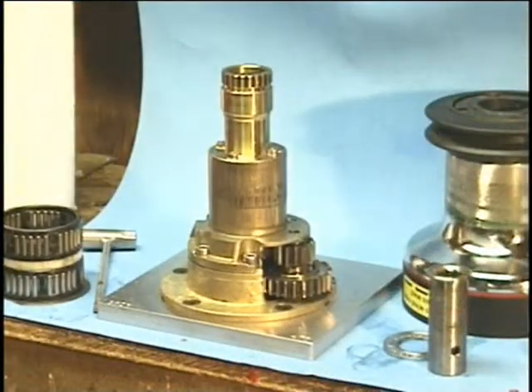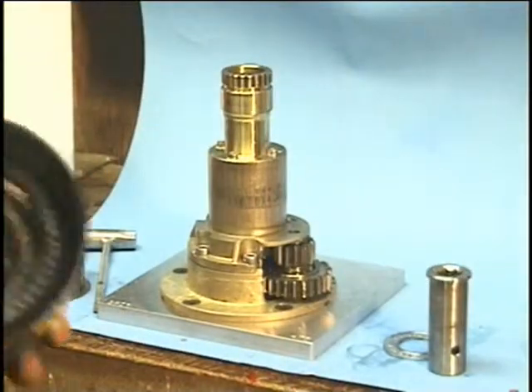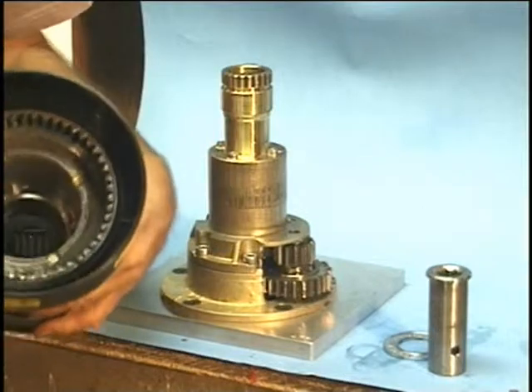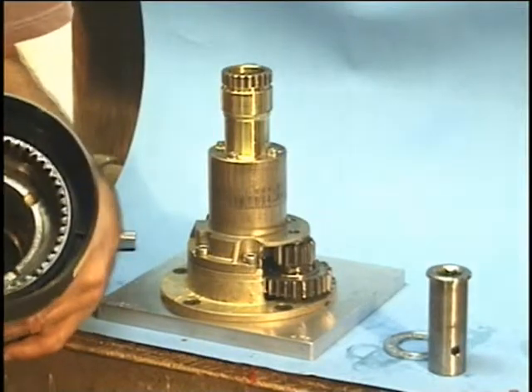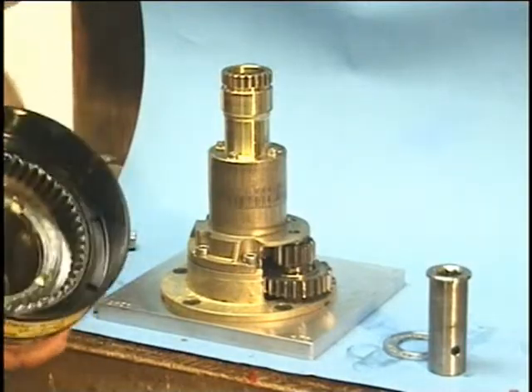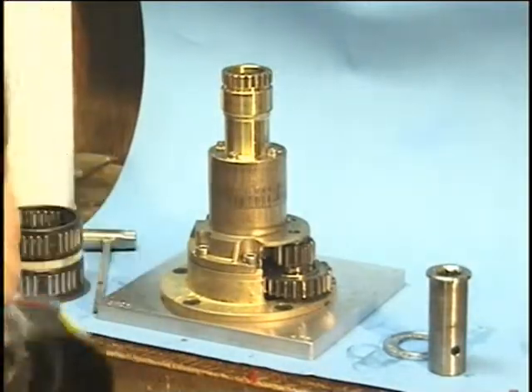It's also important that inside the drum there's the rack gear — all the teeth that do the actual turning of the drum. It's crucial to get those clean. Also clean the inside bearing journal that's on the inside of the drum.